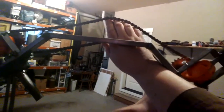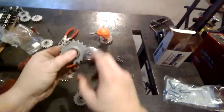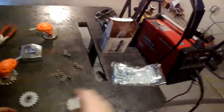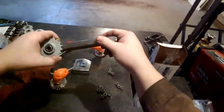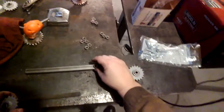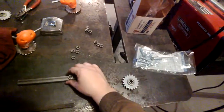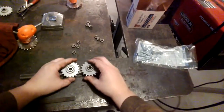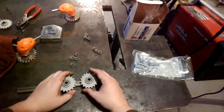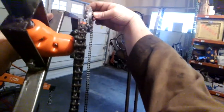I've been out here poking at it for a bit and I think I have an idea of what I'm going to do. So we have these idler sprockets with their own bearing in there - quite nice. Those will mount onto this three-quarter inch square tube; you can just weld on more of those nuts and they can bolt on. The nice thing about that is, by moving the bolt in and out a little bit with the jam nut in there, I can adjust the spacing out, because the sprocket has to be the exact right distance out.